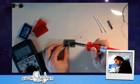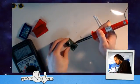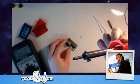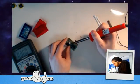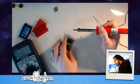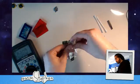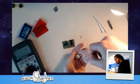There's also a bunch of resistors, these tiny little guys, beside all the solder points as well. So if you have a fat soldering iron like I do, use a very steady hand, because if you slip, you're gonna mess these guys up a lot. The older series are much easier to fix. Brand new batteries.